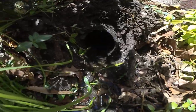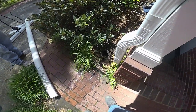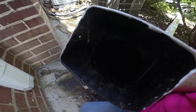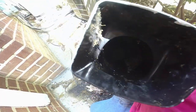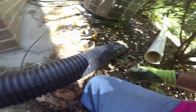That's all the water that's in that pipe just being held in there because it wasn't sloped properly - or sloped at all, as Jeremy said. I wanted to show you, look at the water in there. It's interesting because even when I'm holding the pipe up at this angle, you can see that this corrugated pipe holds water. Those ribs just hold the water. You'd never want to use this stuff because it impedes the flow too much.